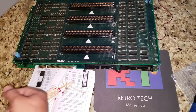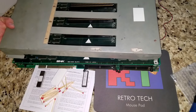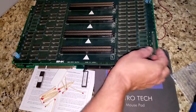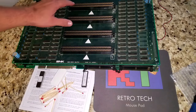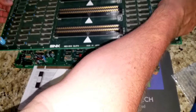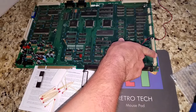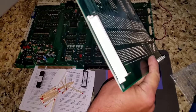I've already got all the screws taken out here, but you can see it's pretty easy. There were some screws around the corners to take off this shielding, and then there were some more screws around the cartridge ports in the corners. Then you just slowly disconnect that from each of these white connectors that match up to the bottom or the top board.